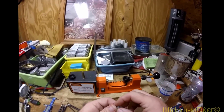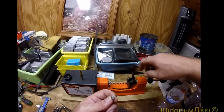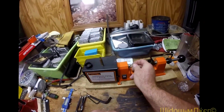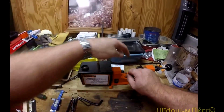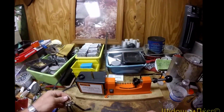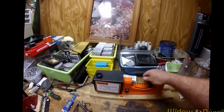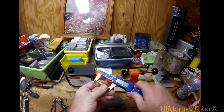And we'll go on to the next particular trimmer, case trimmer. You have pilots, certain size pilots that you have to use. So I had a 30 cal in there. Real simply, you just unscrew that right there, pull it out, put your 22 in there, tighten it down. Simple as pie. Alright, now for the next part of this, what you have to do is put a case in there that's a master case, if you will, to be right on the money.